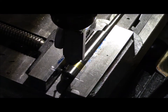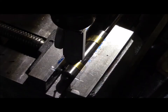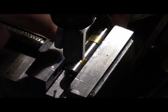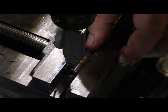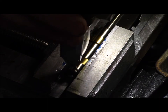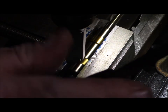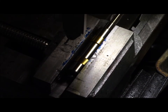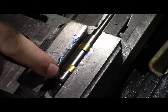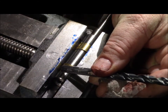Fixing to drill this hole, but I need to put these brass shims in here so I can get a decent reading off the jaws. I backed it off to ten and now it's at fourteen — we'll go to twelve. We're within a half-thou, so not complaining. I came over an eighth inch from the edge, then found the center of my five-sixteenths, and just by holding a bit right next to it, it looks pretty good.